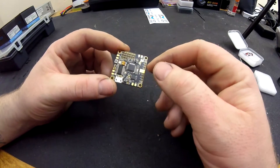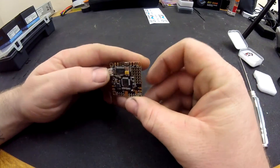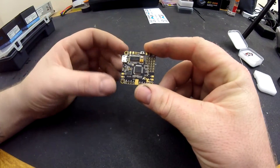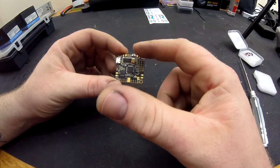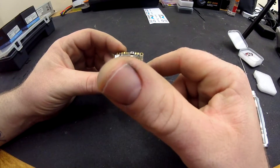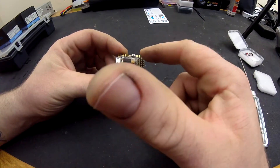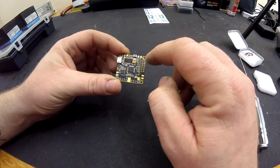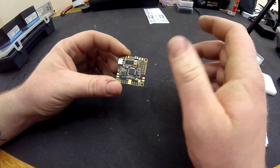When you put the board in, you've got your little arrow on the side here. You always put the board in facing forward so the USB is on the side so you get access to it. Each individual motor output - the two back ones are on this side, so that's motor 1 and 3, and then 2 and 4 are on the top. You can just link your wires straight in - that's your ground and signal wire from the ESCs.